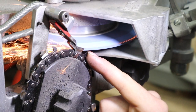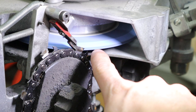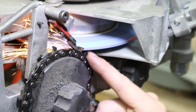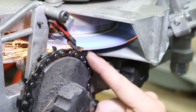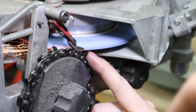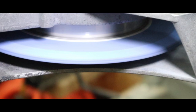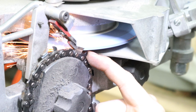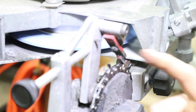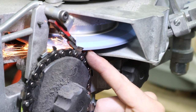As Ethan brings this tooth into the stone, you can see this coloration — this dark blue line here on the edge. Right where you see the sparks going around, that is the actual edge of the stone. It's beveled out here and then it's beveled in on the face of the stone. I'll roll in some close profile shots to show you exactly what it looks like standing still. But it allows that nice corner to come right up in the tooth of the chain. I'm really impressed with how it cuts — I didn't realize how much smoother it would be.